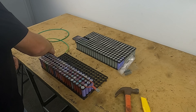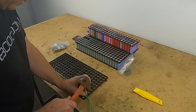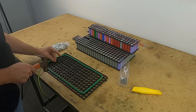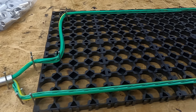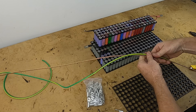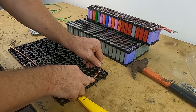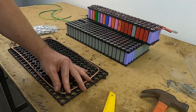Using an empty 10x20 cell holder as a template, I used small nails nailed directly into my bench to make a rough template for my bus bars. I initially used stripped plastic insulator from the wire to figure out the cable length needed. I'm using 10mm square, or 7 gauge wire, typically used for earth wire in modern Australian homes for 240V power. We strip off the green insulator, then twist the copper with a power drill — just a little bit more than standard. If the wire isn't straight, try reversing the drill's direction and then forward again while applying light pressure; the wire will quickly straighten and look much better.